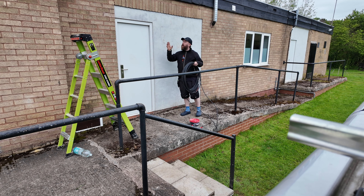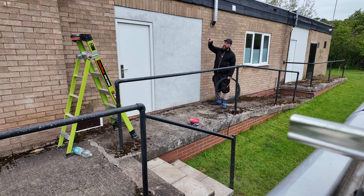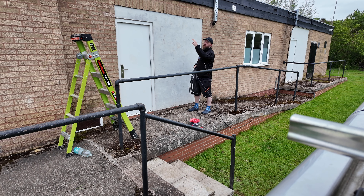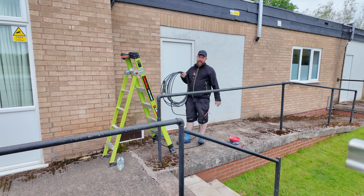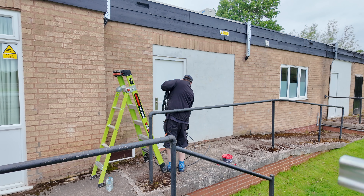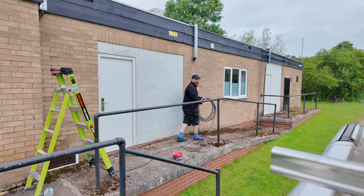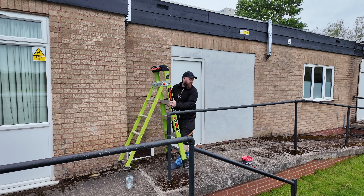The first floodlight is above the window - there are a few obstacles in the way such as a bit of tray work going up to the air con and another bit of tray work. We're using 1.5mm 3-core armoured and we're going to pull it round the back of the tray work so we can cleat it to the wood above. If your armoured comes taped together in a coil, you want to wind it out rather than just pulling it off - put the end on the floor and walk it out the same way it's been coiled up, to get rid of any kinks or loops.